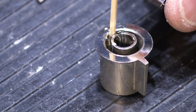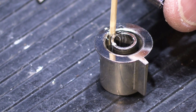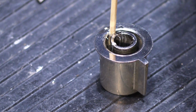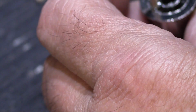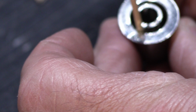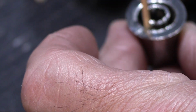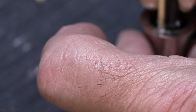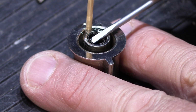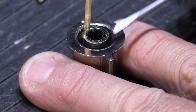Once you get that much in, you have to put the little metal sleeve in now, because the super glue is going to dry, and when it dries it gets hard and it could be lumpy, and it could prevent the little sleeve from fitting in properly. So if you look down in the opening, you can see the D shape with the bump out part. I can't necessarily show you this easily, but if you look into the opening carefully, you'll see the shape, and then you line up the sleeve like that, and push it down inside, and it should be flush across here.